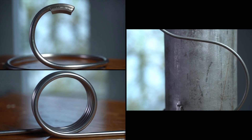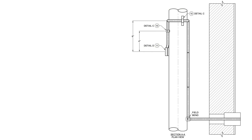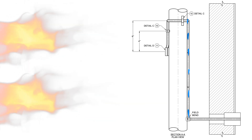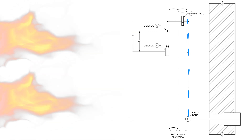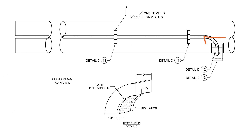There's one additional distinguishing feature of tube skin thermocouples worth mentioning. When these instruments are installed in the heater, the majority of the thermocouple probe is routed along the cold or shaded side of the tube, thereby protected from direct flame impingement. The only portion of the sensor on the hot side of the tube will be the sensing tip. To protect this part of the TSTC anatomy, heat shields are commonly installed directly atop the measuring location.